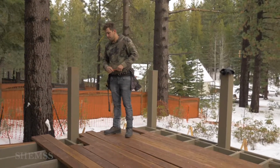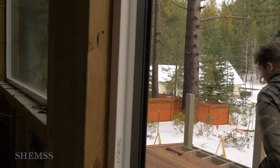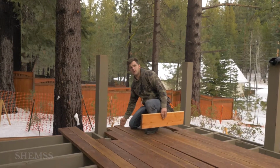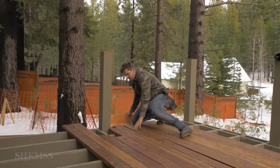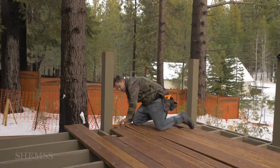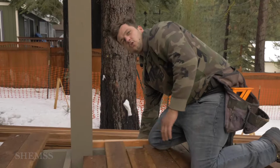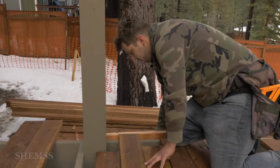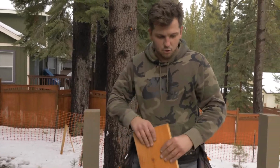So first things first, what we're gonna do is cut a 2x6 as our skirt, and instead of the ends just sticking over and being exposed and visible, we're gonna put a 2x6 redwood, one of these that are stained already, up on the edge, about 1.5 inches, which is the thickness of our redwood, and our redwood is gonna butt into our face. So it makes the job look more seamless, more straight, and better than just going over or doing a regular bull nose or what other people do.